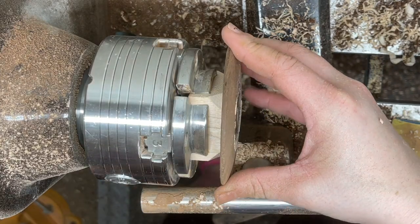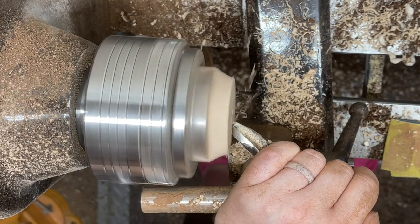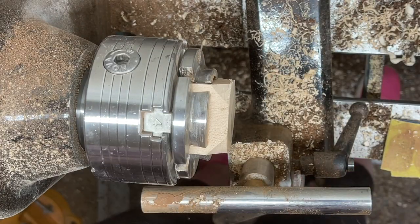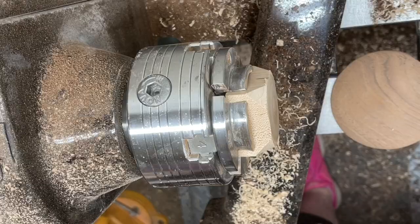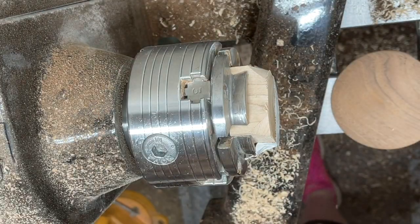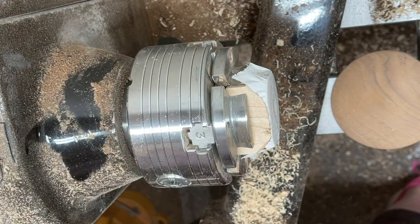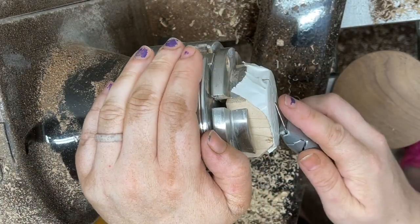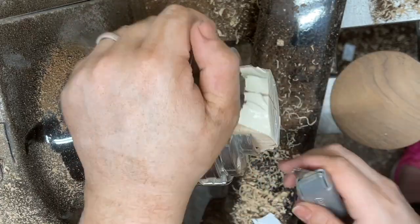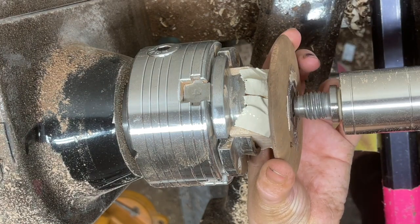Check the piece, because it is being taped instead of glued, so it's not going to be as secure — make sure it doesn't wobble. If it does, just refine that shape a little bit so that you get a nice secure surface. I'm going to stick double-sided tape on there — this is Woodturner's tape, it's really strong and sometimes it leaves a residue. It's also really difficult to get the backing off the tape, so I take a utility knife and slice a line down the center of the tape, and that makes it a lot easier to peel up from the center rather than going at it from a corner.